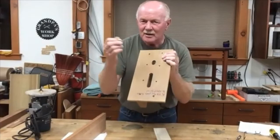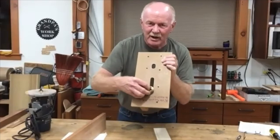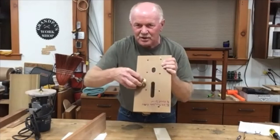Conversely, if you make it too loose, then it can rattle around in there side to side as you go down, and you end up without a smooth edge on either side. If you know it's doing that, then on your final pass, you pull it to this side, run down here, you push it to the other side and come up there.